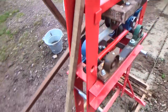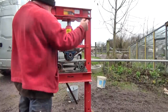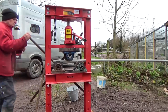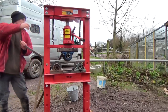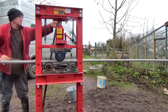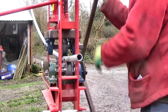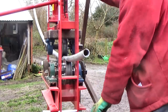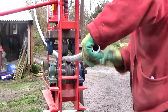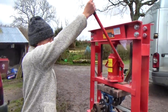At this point I thought I'd be clever and make a ring to fit onto the handle of the pipe roller to make it easier to turn. I had some pipe the right length too, and immediately things started going wrong. Instead of a nice straight curve, it turned into a spiral.